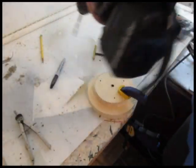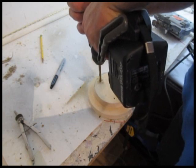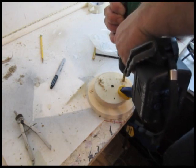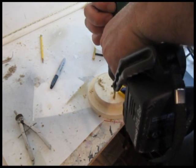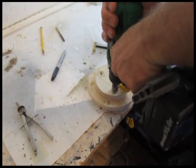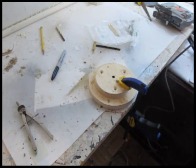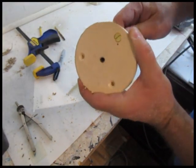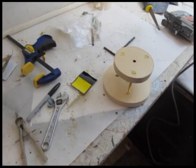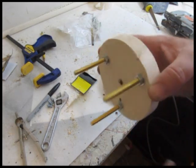Now let's build it. Put the discs one over the other, centered exactly. I actually drilled the center hole and pinned it in the middle so they both stayed centered. Drill them out a little over a quarter inch because we're going to put quarter-inch bolts in there — one-sixteenth over a quarter inch is fine. Three holes equally distant around. Then I countersunk them so the flat-head screws will fit snug — we're putting the mirror on top of that and don't want the screws sticking out. Put those three bolts in; they're quarter-twenty by three inches long, with nuts and washers underneath to hold them tight.